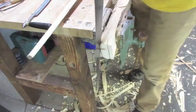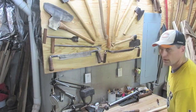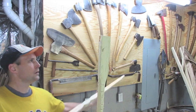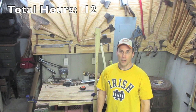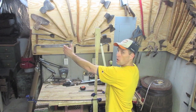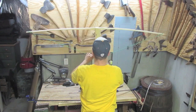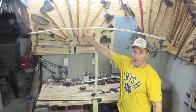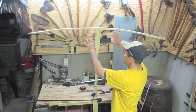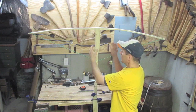Now I need to make a tillering stick. A tillering stick has two primary purposes. First, it's used to condition the limbs so they get used to being bent. But secondly and more importantly, they're used to bend the bow and assess how evenly the limbs are bending. It may not be obvious, but this side bends a lot more than this side. There's a thin spot right here, so I need to take material out of this side and re-tiller it. As I continue to take material out to reduce the poundage, I'll continue to tiller it farther and farther down to condition the limbs and make sure they're bending evenly.